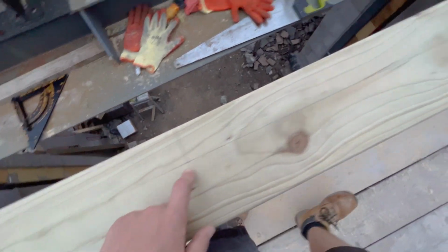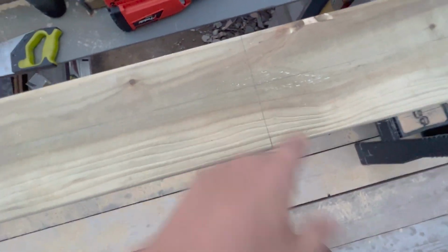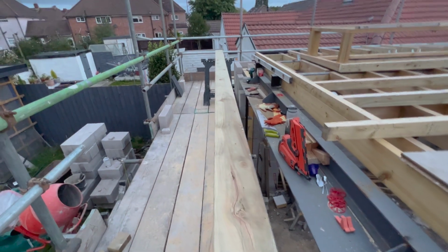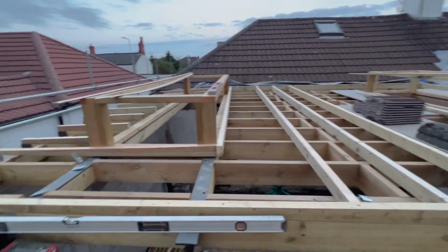And that's 122, that's 93.5, that is, let me just check because I can't even think, 79, and then that's 65. So once you start sawing down your line, it goes all the way down perfect, and you might get a tiny mil or two discrepancy, but that's the easiest way I find if you haven't got a string line and you haven't got a jig set up and you need to do all your furring pieces individually. So yeah.